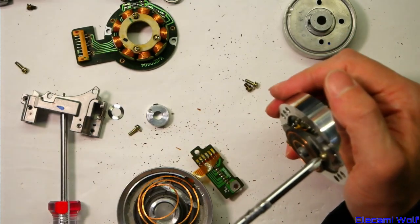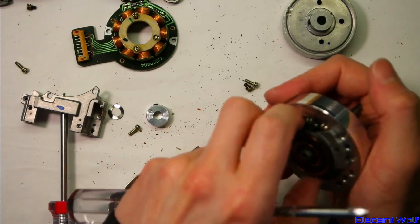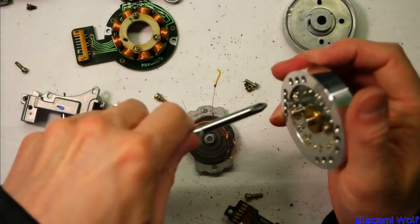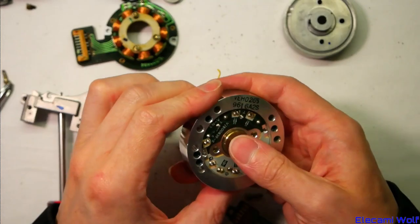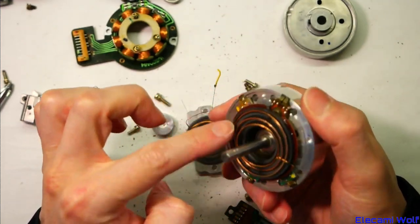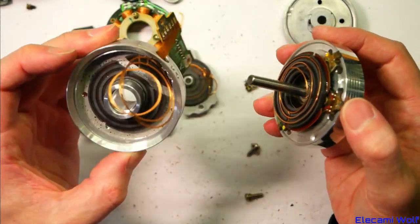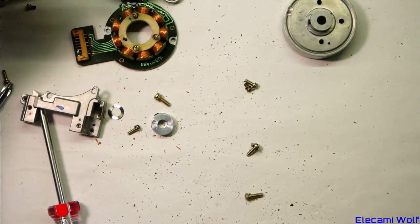You can get closer by taking this top piece off, then taking the top of the head drum off, and then taking that off — but I think the bearing will still be inside an enclosed part. You've got to desolder those bits before you can get it off, then it will separate this part from it, but the bearing is still going to be stuck inside there. Anyway, we can't investigate that because it'll be stuck inside there. Cracked that in the process — that's metal recycling material now. Let's tidy this mess and we'll open up the machine that had bits floating around inside it, perhaps steal the head out of that and stick it into this machine just for fun.